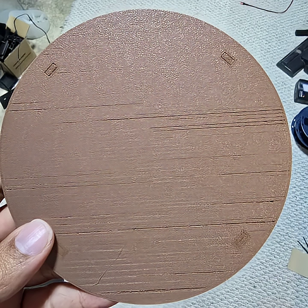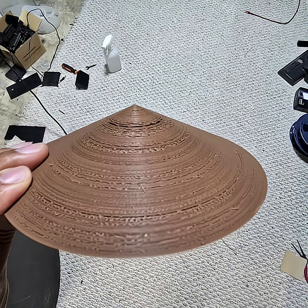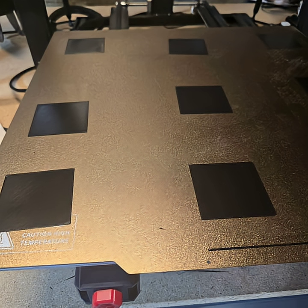The issue it was giving me was very inconsistent extrusion — sometimes it would come out fine, sometimes it would be great. That tells me it's a partially clogged nozzle. Here's basically how the filament looked as it was bulging out. There had to be something in there that was either tightening the space or not allowing it to wrap around.